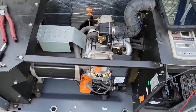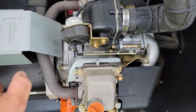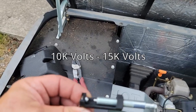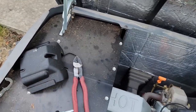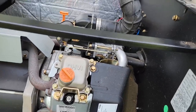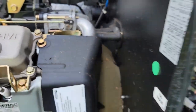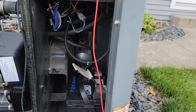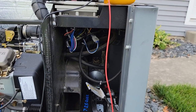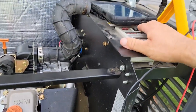What I found out is when we unhook the filter, the frequency goes normal. I ran it with one cylinder on the front, one on the back. I checked my gap in here to see what kind of spark I was getting — I got every bit of 10,000 volts. The front was getting 15,000; the rear barely got maybe 12,000. So I've got pretty strong spark. I'm going to pull these spark plugs out and look at them. I did check all down in here for air leakages and checked the gas pressure — we're at 12 inches — and it ran steady at that.